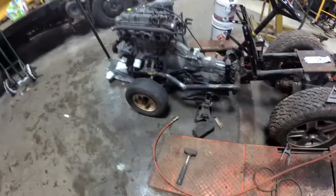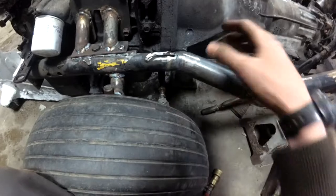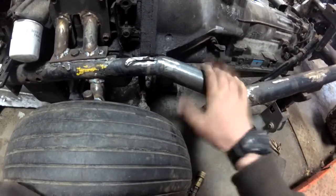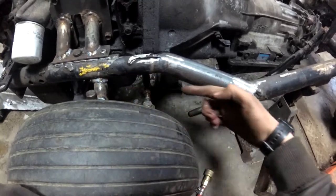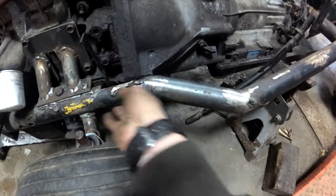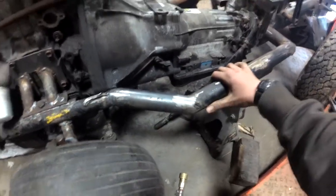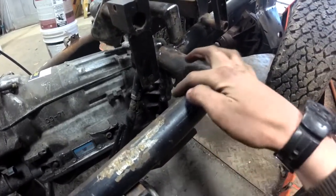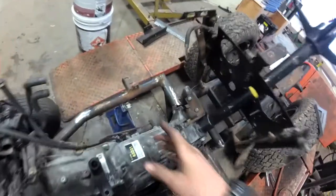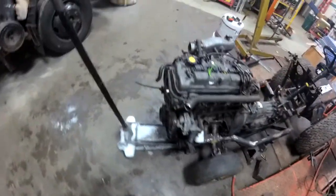I had to pick up more of the one-and-a-quarter-inch tubing I used for this, and I need to get some one-and-a-half or one-and-three-quarter inch tubing for the framing here. I might actually just use angle iron and plate it in as one big piece. I might do the same thing on the inside to make almost a truss in there. This side will get a full gusset, same thing on the outside for the frame.